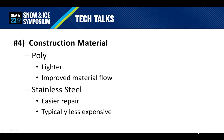And now for the final decision: what type of material is the spreader constructed from? This one isn't too difficult since there are really only two options today — poly or stainless steel. One main advantage of poly is the weight; since they're lighter, they allow for more material to be transported. The other main advantage is material flow, because poly is more slippery than stainless steel and can be molded with complex geometry that feeds the delivery system better. The advantages of stainless steel are that they're easy to repair in case of a mishap, and they typically cost less than poly because of their simpler construction.